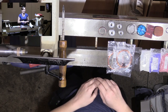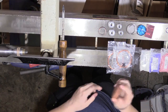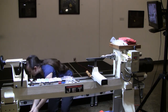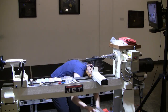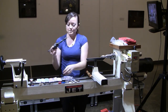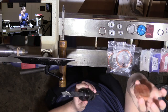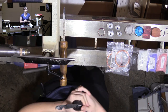Just to go through some of the steps, because I've forgotten things - after selecting my blank, I usually get a drill bit that's just smaller than the inside diameter. Sometimes it's a little bit more, but this is what I had handy. I'll go ahead and drill out the center of my blank. Once I get it pretty close, depending on the wood, sometimes I'll add CA to strengthen it.